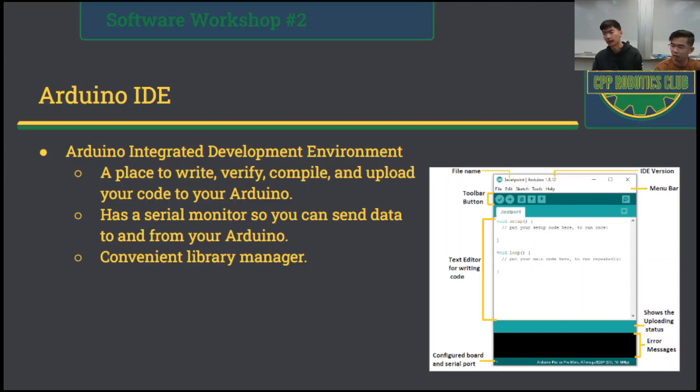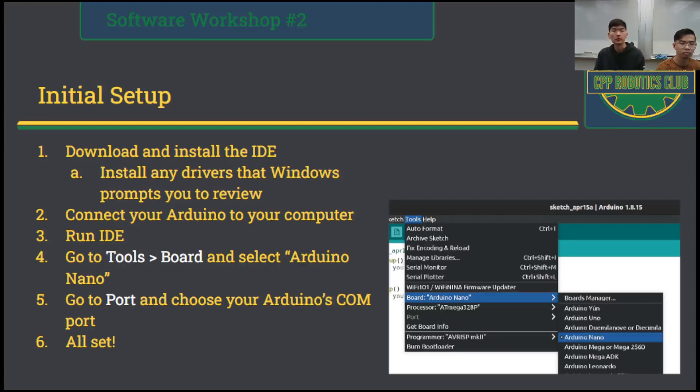It's also packed with a lot of libraries that you can add through the Library Manager. If you saw our announcement a few days ago, you should have already installed the IDE. If you don't have it, that's okay — you can just Google for Arduino IDE and click on whatever first result comes up. When you install the IDE, they'll ask you to install some drivers — just go ahead and install those, they're safe to install. Note that the screenshot shown is the older version of Arduino — you probably have Arduino 2, which looks a little different, but functionality-wise it's identical.